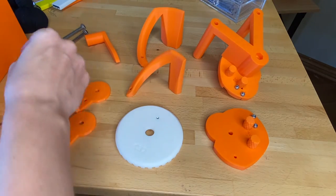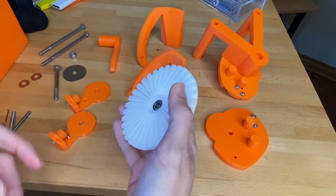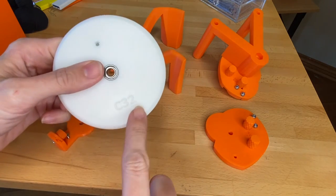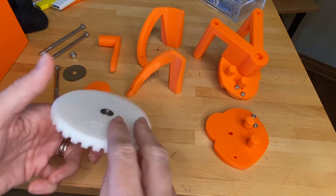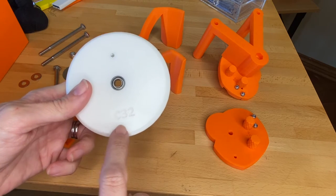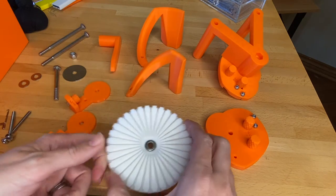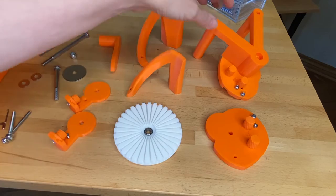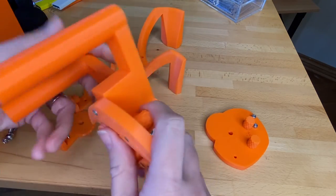As a general rule you want the ribber to be pretty low, because that will help you keep from dropping stitches. Then you have the ribber dials, which are stamped with the number at the bottom. Remember there are always half as many needles in the dial as there are in the cylinder. This is the C32 — compound 32 — ribber dial, which goes with the compound 64 cylinder. For our demonstration today we're going to set up for this compound 32.